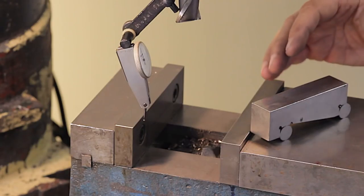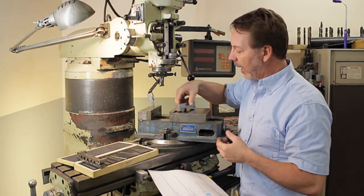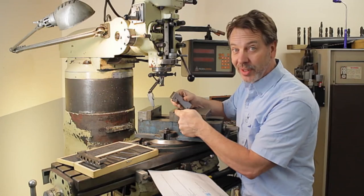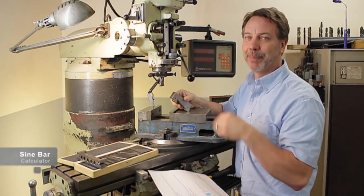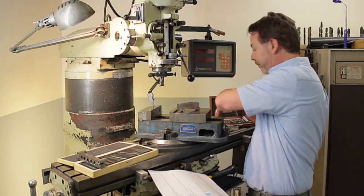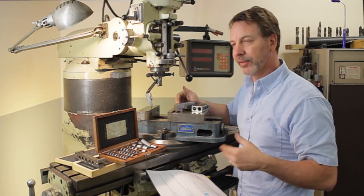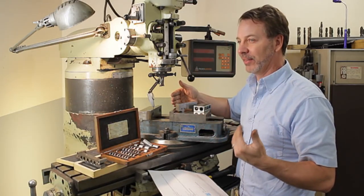Here are a couple of sine bars. I've got a 5-inch sine bar here — this one is really unique because it has these little outriggers and helps you get into other positions. Here's a 3-inch one, which I'm going to demonstrate with today. I'm not going to go into how to use the sine bar correctly in full detail right now — someday I'll do a full video on sine bars. But the idea of a sine bar is you have two pivot points, and if you know what angle you want, you can make a calculation. It's a very easy calculation. You just go to your phone, type in sine bar calculator, punch in the angle — say 30 degrees with a 3-inch sine bar — and a particular number will come out.